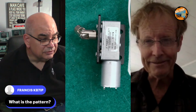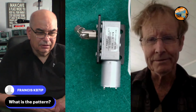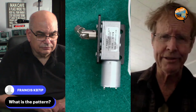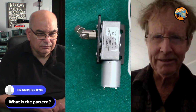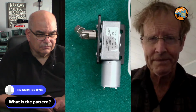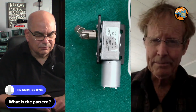All right. Good question. If a magnetic loop were a wheel, the direction of the axle in both directions is a very deep null. I had a 4-footer, and I put a lot of capacitance, and I was listening on the AM band, and I could get 50 dBs of null. But the smaller the loop, and of course 4 feet in the broadcast band is tiny, way too tiny for transmit. You get 50 dB there, but you can get a good 10 or 20 dB with the transmit loop.